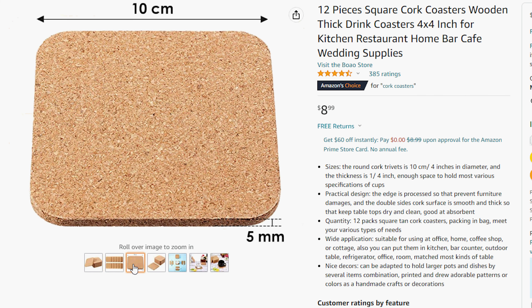The chipboard we use is 12 by 12 inches and will be inserted into the top left corner of the laser bed, with the product placed on it, so I wanted to mark this area on the canvas. I dragged some guidelines onto the canvas to represent the exact dimensions of the area I was working with. I knew my coasters were 3.92 inches square, so I made boxes on the canvas to represent them, but made them just a little bigger — these are the lines that get marked on the chipboard, so making them slightly larger makes it easier to position the coasters within them.